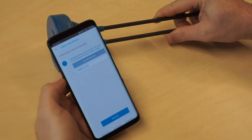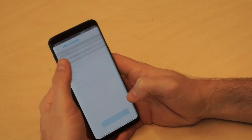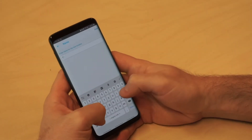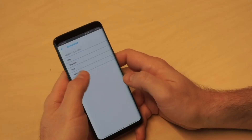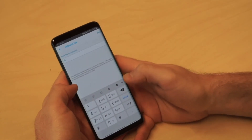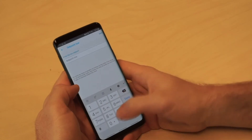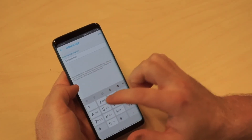You can also enter the serial number manually. From there, you move through to assigning the relevant properties to the sensor. You can assign a location — which is key if you'd like to separate sensors into different groups. You can give the sensor a friendly or unique name, such as 'Potato field, northwest corner' or '30 centimeter sensor, beets.' You can then select the soil type — we have 12 soil types available — and edit the thresholds for the wet and dry regions of your soil.